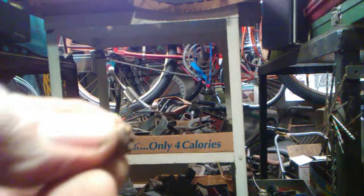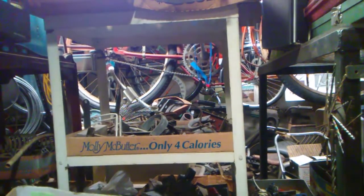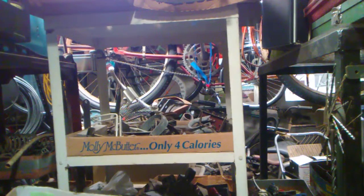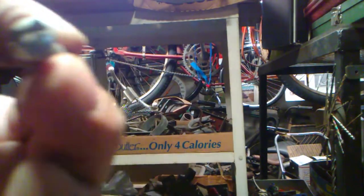And back then, Whitworth bolts that held on the primary covers and anything else on those motorcycles were $1 a bolt. Well, that's out. You could get drunk for $1 back then, so I wasn't about to spend it. I would weld them shut, dress them up, cut a split in them with a hacksaw, and go on with them.